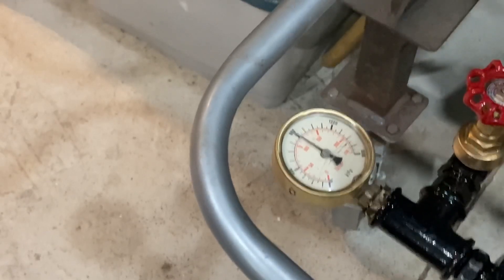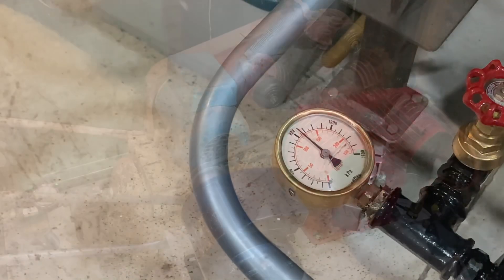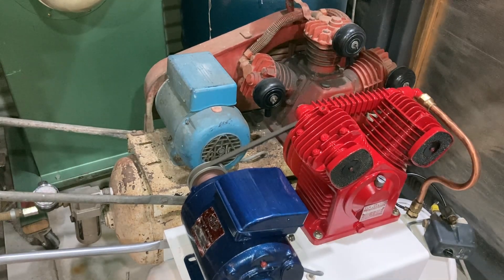Here it is running — you can see that gauge come up pretty good too. There's big brother in the background. I'll explain how I've got these two set up: my garage is split into two 16-amp circuits and there's one 32-amp circuit in the meter box. I plug the big one into one circuit and the smaller one into the other. I've got a 5-pound differential between each compressor, so one kicks in at 85 pounds and the other at 80 pounds — that way they never start at the same time. They run very well together, and my sandblasting now is incredible.